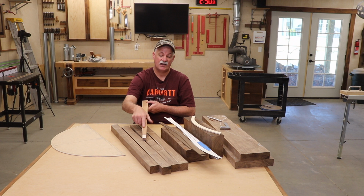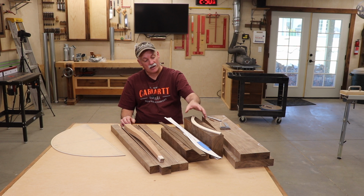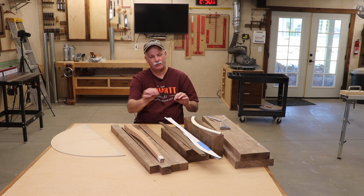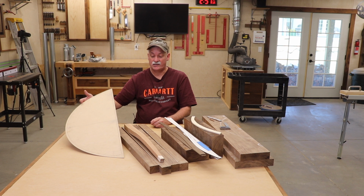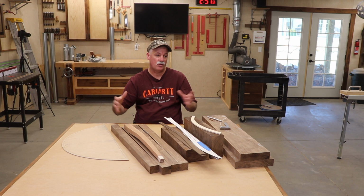Back to the aprons briefly. I also think on the bottom of the apron, I'm going to do a small maple lip with a little bead detail on it. Again, just a subtle detail to tie it back into that Maloof rocker. I do have a template for the top, so this is kind of what I based all these parts off of.